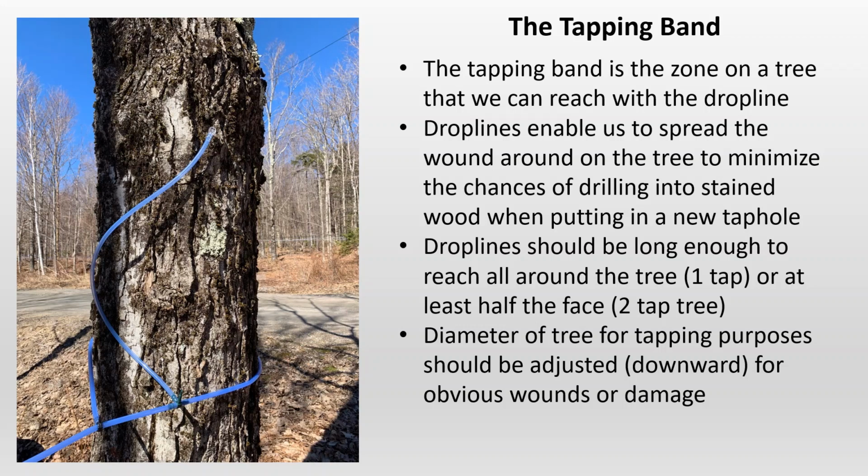So do you know what the cutoff low point of the vacuum is that will work well? Speculation is 23. In the earlier rounds of testing before it moved into the big experiment, at 23, it didn't seem to work as well. So get above 23, 25 better. And you're talking vacuum at the tap hole or pretty close or within a couple feet of it? This was at the end of the line. So at Proctor, we're using smart track sensors, so they all tell us the vacuum at the end of each line.